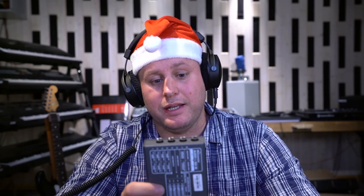But if you have only one digital mixer with no outboard clock source and with a really short digital audio cable on the right side of your mixer, let's say a half meter of AES/EBU cable, then it's okay. Because with this you will get 8 digital audio channels that you can insert into your SDI video stream.